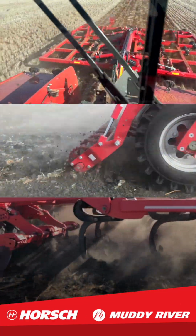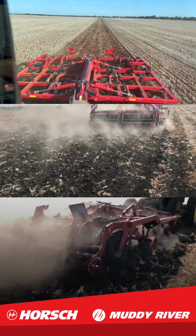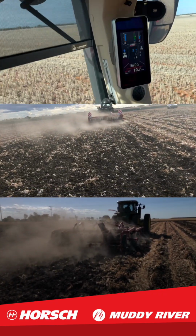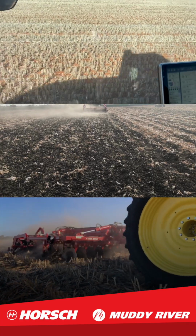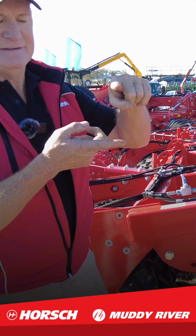And we've had clients that have had 4.5 pH levels, put out 2.5, 3 ton of lime with this machine, come back, do a test the next year, pH is at 5.5. So that's a big factor. A lot of machines will get it down to 5 to 10 centimetres. This will be 30 to 35 centimetres.